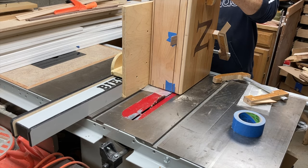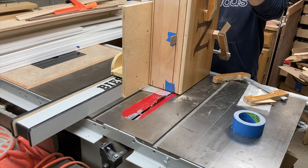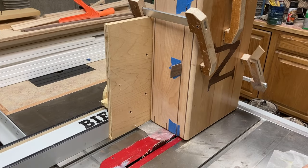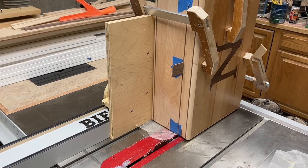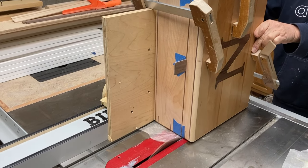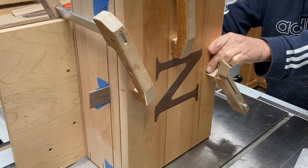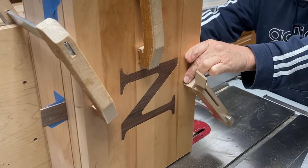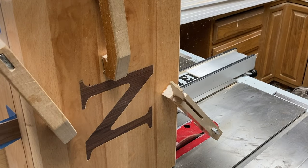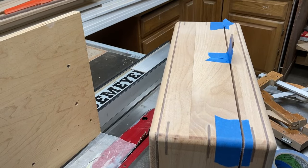The lid is sort of hovering over space, so after the third cut you definitely want to fill all those gaps with eighth inch spacers. Tightly tape the box so that the lid doesn't hinge on that last remaining long side. Once I've made the third cut I'll take it off and put even more spacers so that the lid will stay at a uniform distance.